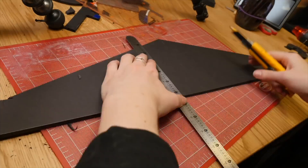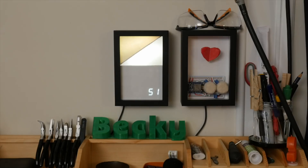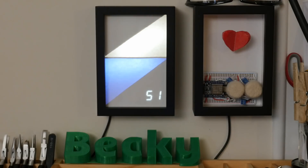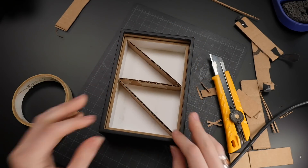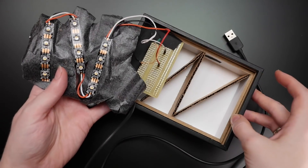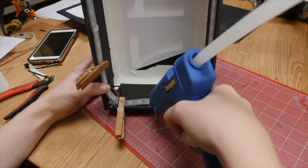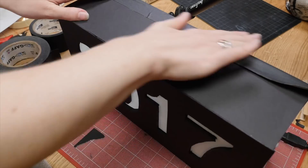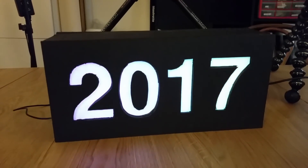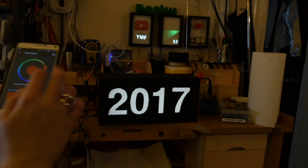Just use a box, either homemade or easily found — a shadow box frame for example — and line the inside with plain printer paper. In my Wi-Fi weather display project, I broke the shadow box up into sections with a folded piece of corrugated cardboard, then taped some pixel strips to the back, shining into each triangle shape. The simplest form of this technique is just to line the walls of the box with a single LED strip. Make the inside of the box white so the light can bounce around, and create a cut-out face with the design of your choice.